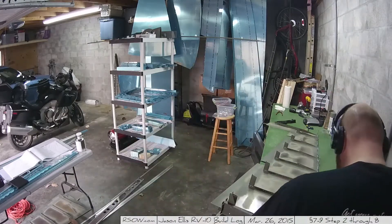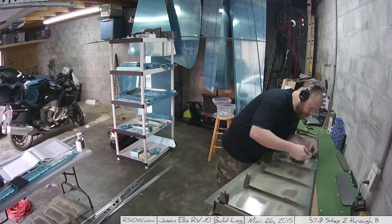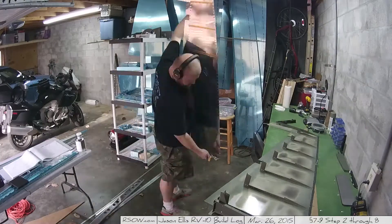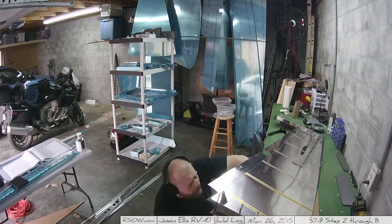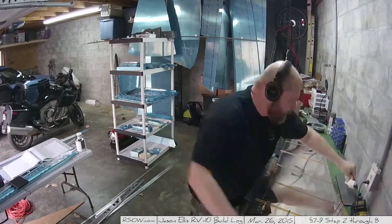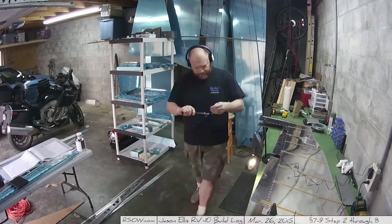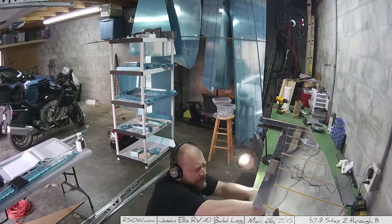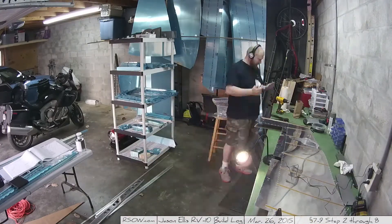It covered my hands for days. Once I got it all mixed up according to the proportion, which is 10 to 1, I applied it to one side and then stuck the piece on with a couple of clecos, then applied it to the other side before getting the second skin set up. Then it's just a matter of going through and clecos-ing down the pieces and using the pop rivet gun to rivet those inside pieces. A little difficult to reach in there, but once I figured it out, it was just a matter of going through each one and setting the rivet.